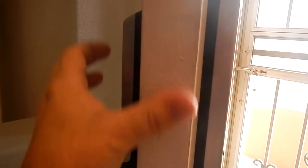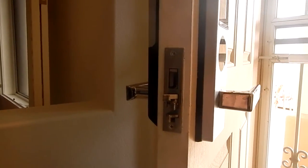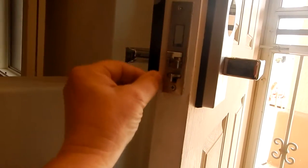For this area on the edge of the door, I had the deadbolt hole right here. I filled that in with Durham's water putty, which is absolutely wonderful stuff. You can get it at Lowe's or Home Depot — it's called Durham's water putty, comes in a little can or a big can. It's a powder; you mix it with water and fill it in. Once it's in, you can sand it and paint it. I also used it around the mortise hole where I used a one-inch speed bore wood bit to drill — it wasn't a perfect hole, so I filled in the rough edges, sanded it down, and painted it so it looks fine.